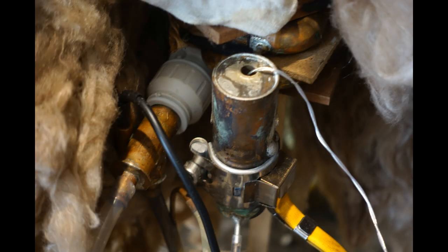The preheater is a pretty simple device made of a 100 millimetre length of 28 millimetre copper piping, closed at either end with two pence UK sterling coins that happen to fit perfectly inside a 28 millimetre pipe. At the bottom there is a three millimetre brass pipe for wash inflow, above which is a band heater of 80 watts. At the top is a thermal well for the temperature sensor and a short three millimetre diameter brass outflow pipe carrying the hot wash into the column.